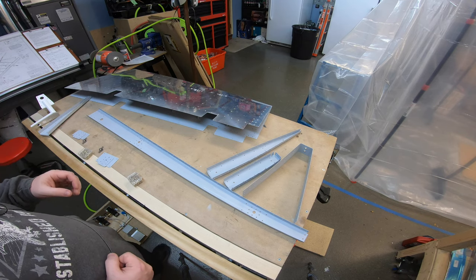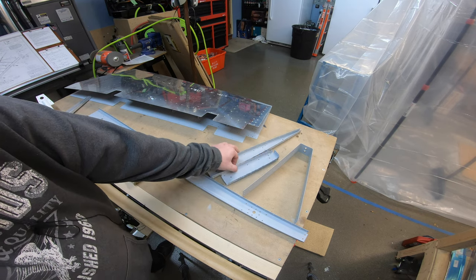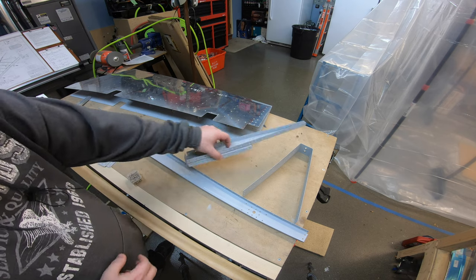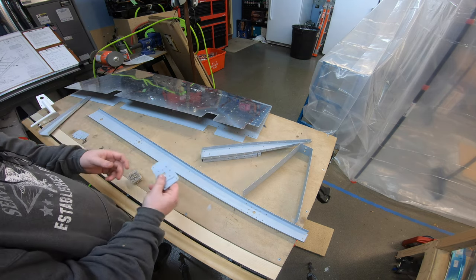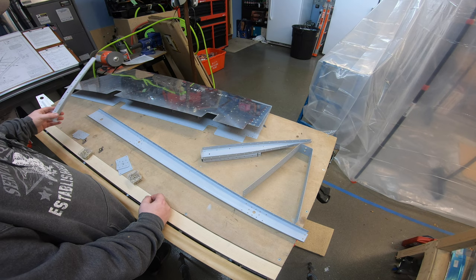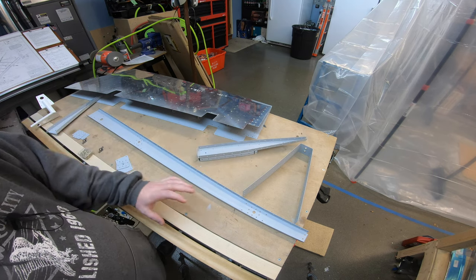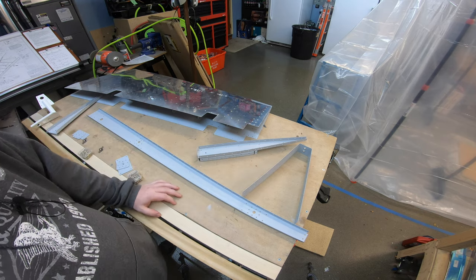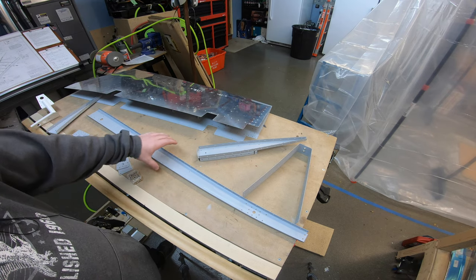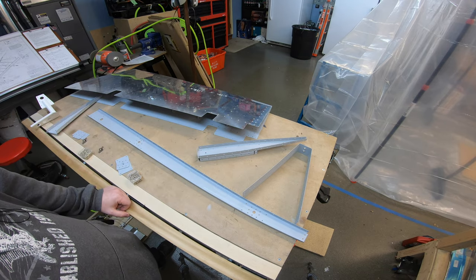It's finally time to start riveting all of the sub-assembly to the right elevator skin. We're going to start with riveting the 703 to the 704, then rivet our doublers and brackets to the 702 rear spar, then continue with the 709 to the rear spar as well as the weldment. Then we'll rivet this assembly to the spar, rivet the 713 just the first two holes into the skin, wedge this assembly into the elevator, and rivet everything around the edges.